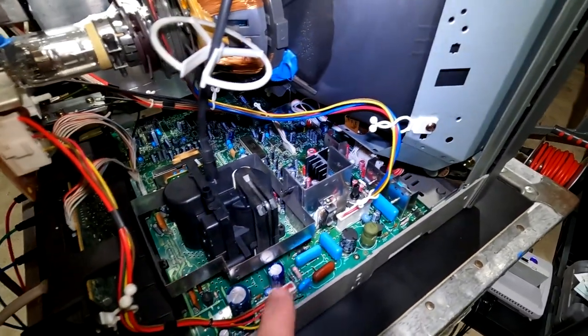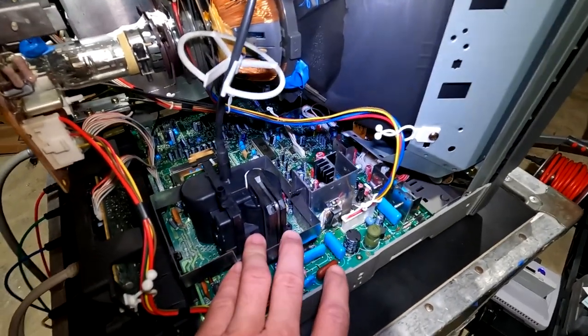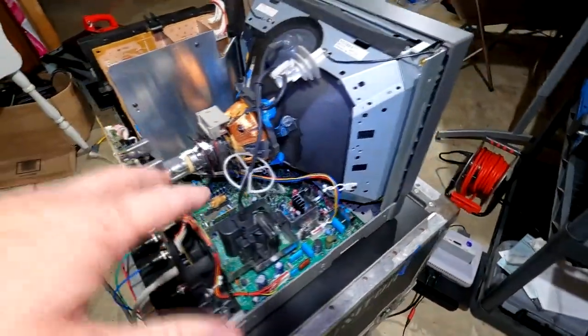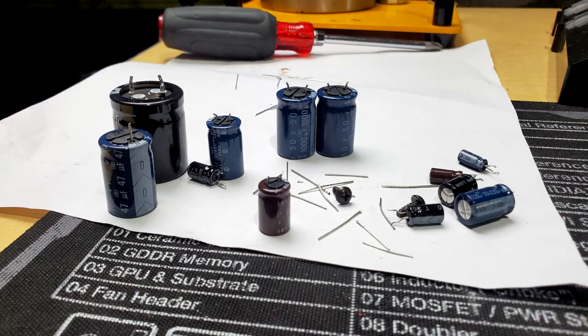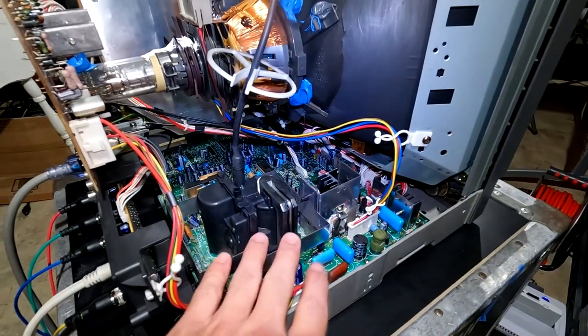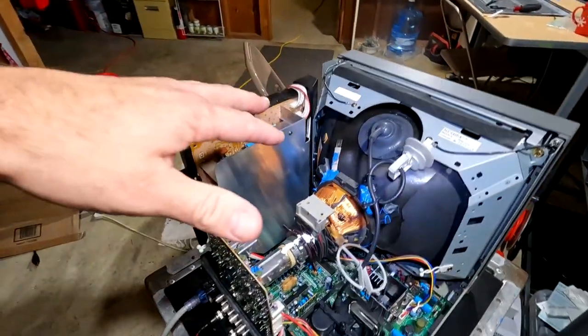There are cables and connections going to all other places, but this board had some major issues — lots of bad capacitors. What I had to do was make a specific cap kit for this. I was able to live stream the entire recapping of this chassis, all the way from when it had the bad caps in it, to removing those, installing new ones, and then testing it. I'll put a link for that right here and in the description. Once it was serviced and reinstalled, it's been working perfectly since then.